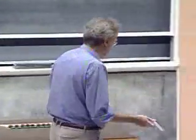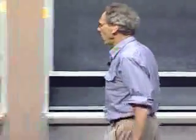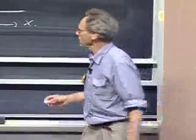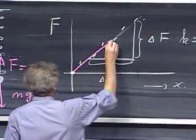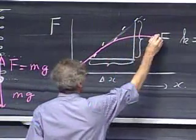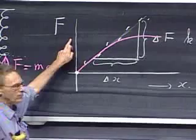For sure, Hooke's law is no longer acting. Look how much longer this spring is than it was before. So there comes, of course, a limit how far you can go before you permanently deform the spring. What I have done now with that spring, probably in the beginning, I went up along this straight line, and then something like this must have happened. I got a huge extension. My force did not increase very much.